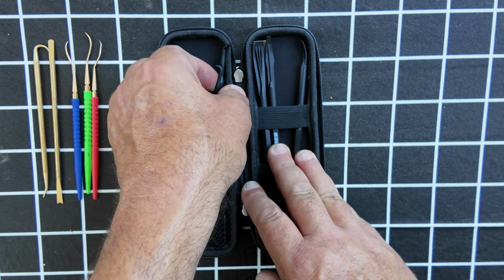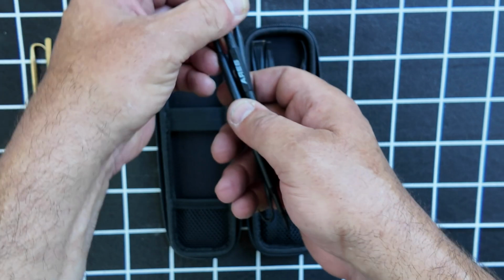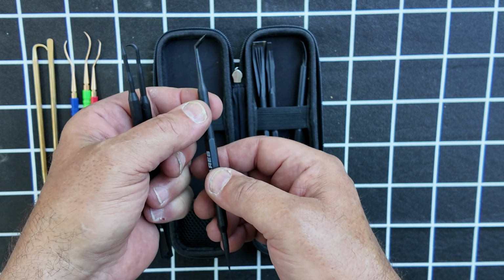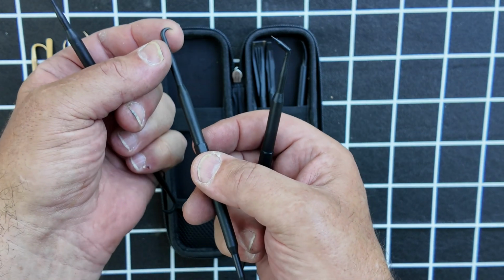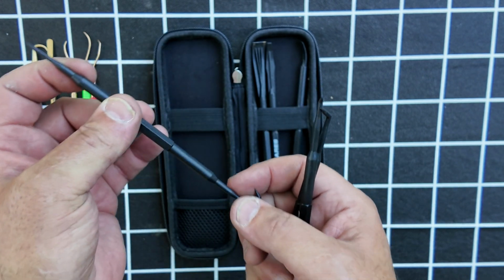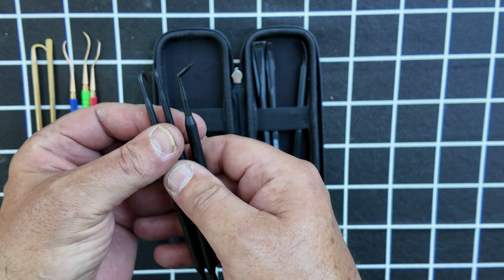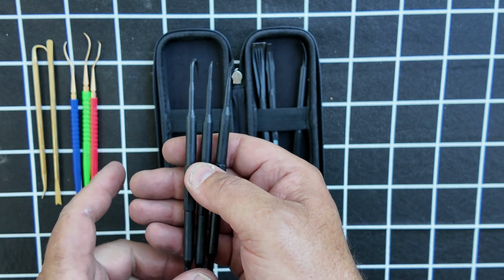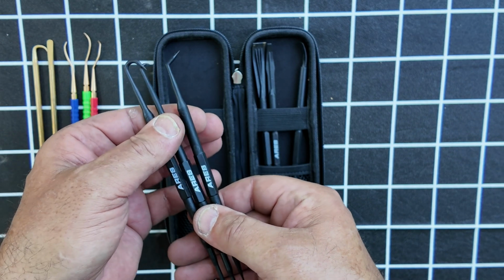Now these are the ones that I really try to use the most. And you'll notice they're kind of segregated. These 3 over here are the ones that are my go-tos. They are all nylon. They're very robust. They have very sharp points. And they're great for getting in and hooking a resistant O-ring. They've got some angled tips, some straight tips, some big hooks. These are great options when you absolutely do not want to scratch the surface that your O-ring is sealing on. These are my go-to for working with soft brass fittings and the like. And they are a great option.